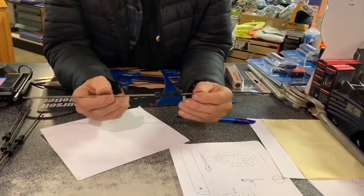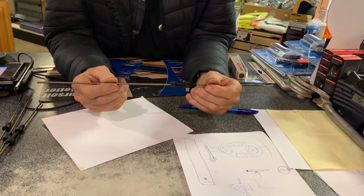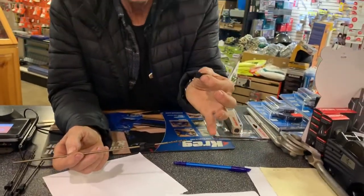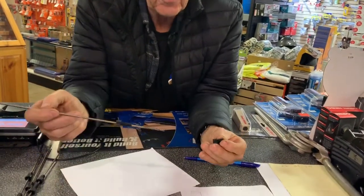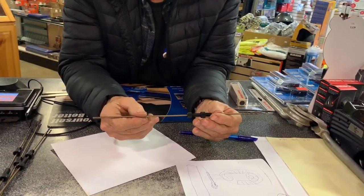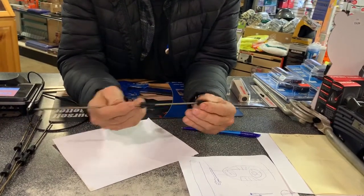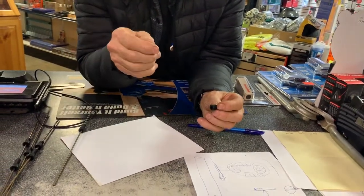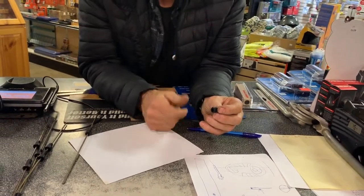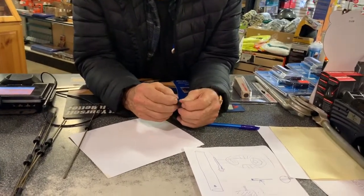This tool sneaks in there and does it in a very short period of time. It only requires installing the guide into the hole where the broken bolt used to go, then inserting the drill and drilling until it meets some resistance — about an inch or so in — then lightly tapping an easy-out into the hole and gently turning it to withdraw the broken pin.